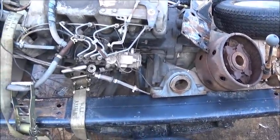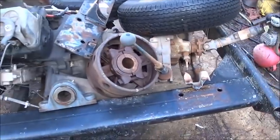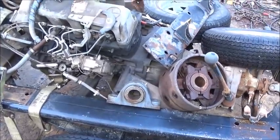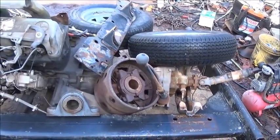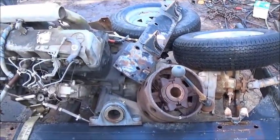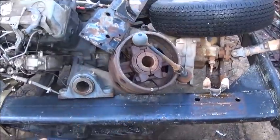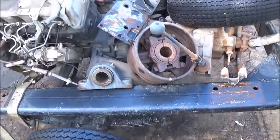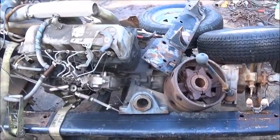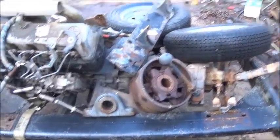All right folks, we'll start on the power unit. We've got the forklifts done as well as they're going to get for the time being, and got the engine unloaded that I needed. I need this for an edger and we're going to try to get it together and put it on the edger and show you how it works, hopefully in this video. It's not a bad job. I've got a two-inch shaft to make for the bearing and the pulley — I want the pulley on the back. I'm not going to put a bearing on the opposite side; this bearing will take the side load so we should be fine. I've got a governor here from a subscriber, whether I'm going to get it hooked up right now or not, I don't know.